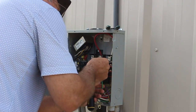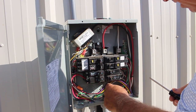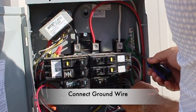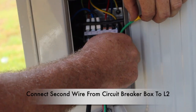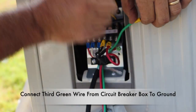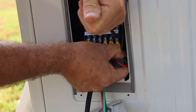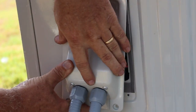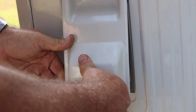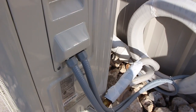When I built the workshop I already knew that the pump for my pool required 220. In addition, I wanted to have 220 outlets in the shop, so I made sure when the pool circuit breaker box was installed I had a couple of extra slots to install a 220 circuit breaker for the AC mini split. Now back at the condenser unit, connect one line from the circuit breaker to L1 and the other to L2; the third green wire goes to ground. Make sure all terminal connections are tightened down and snug. Go ahead and reinstall the condenser terminal panel. You may notice how I have the weather resistant conduit to protect the wires — insert the two screws for the cover and then we are ready for power. This is what the condenser looks like with the conduit and wires installed.